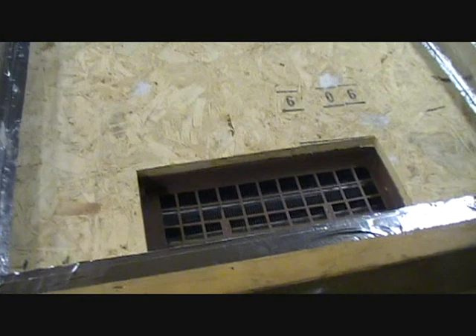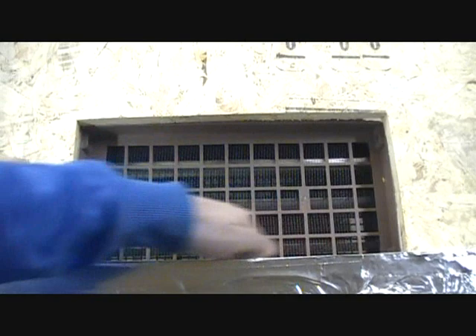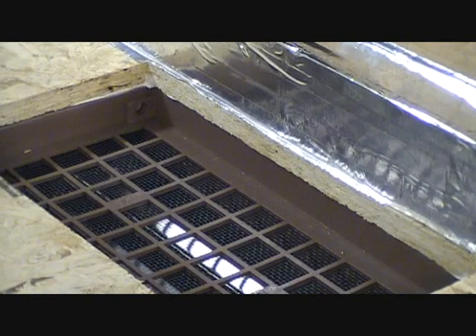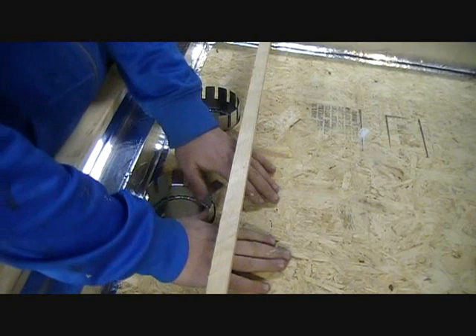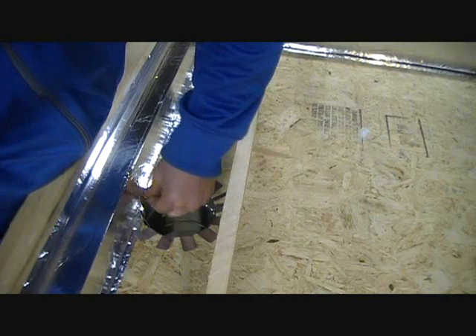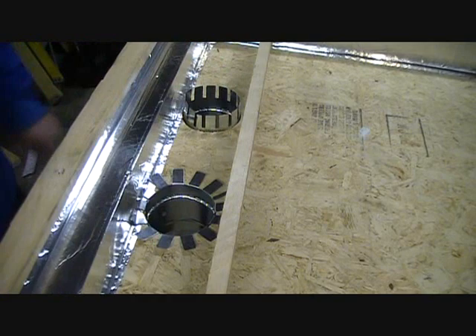Here's the opposite side of the vent we were just installing — pretty much flush all the way around. All I really have to do in here is paint leading into the vent. It ended up basically flush with the edge of the box, which is perfect. On the other end, I've got the fingers sticking up — those are just going to get bent over. To make them stay down and look a little bit nicer, I'm going to use some sheet metal screws to screw these little tabs down. I wanted this as close to flush with the bottom of the box as possible to utilize as much of the airflow inside the box as I could. Put some screws in it, throw some tape on it, and it'll be ready to go.